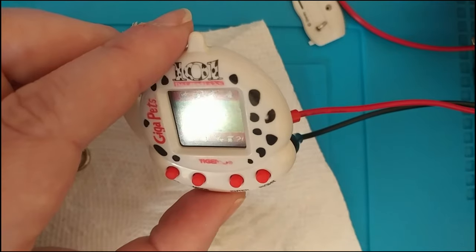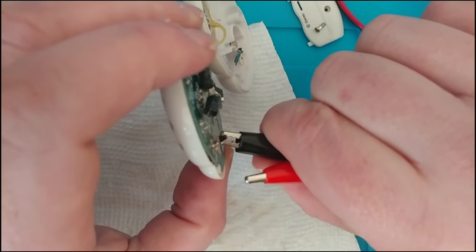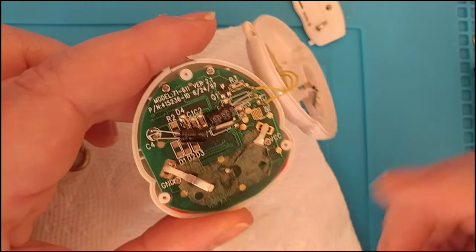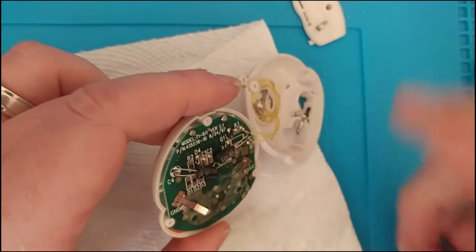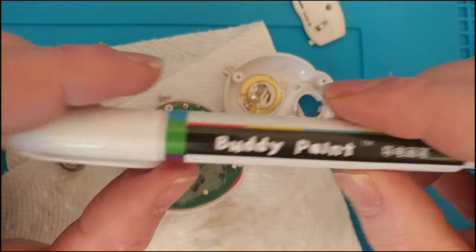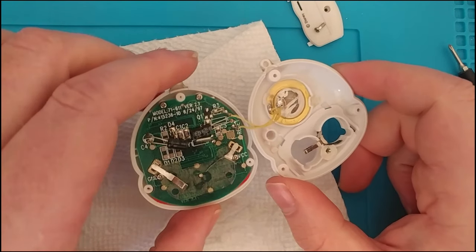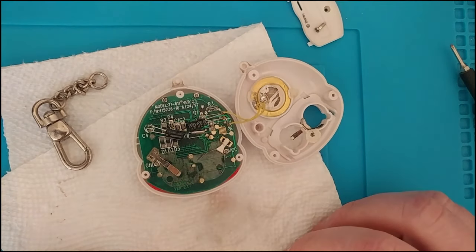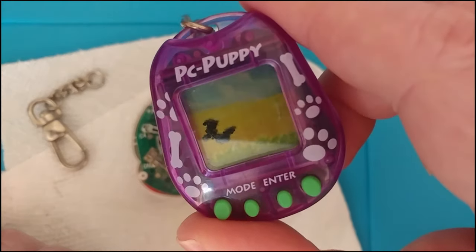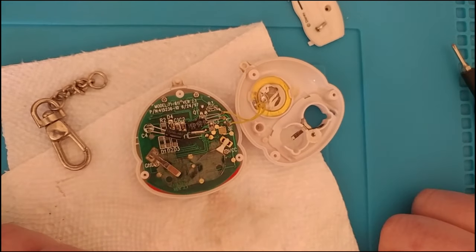There's a bit of extra melted solder and it doesn't look quite factory. This cap here is missing quite a bit of solder — usually you'd like to see it come through to the other side, so we might touch that up. I'm going to check it with my benchtop power supply first, find good points to put these clips on, and just see if it turns on. It does turn on, so we know it is the battery contacts. Left and right are working, sound is working.